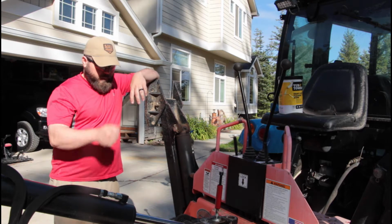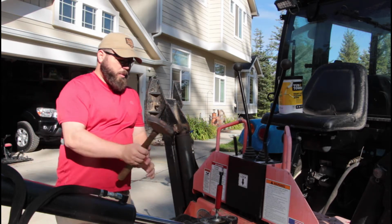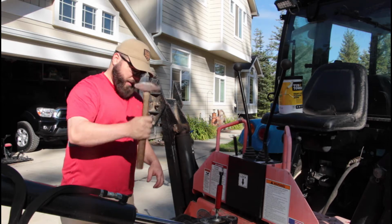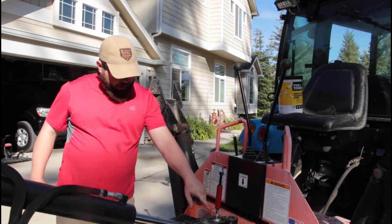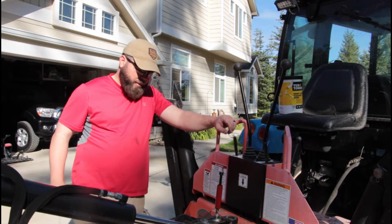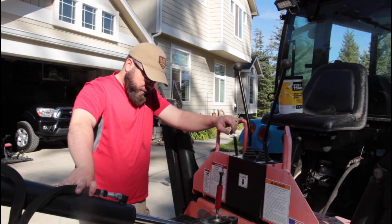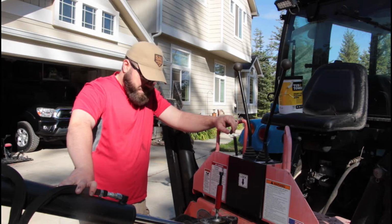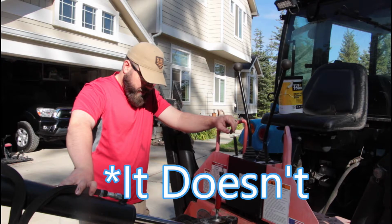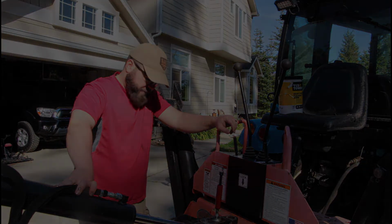And so I let this hammer bounce on there a good while, and it's pretty heavy. I was probably smacking it harder than you're supposed to, but I was also trying to pay attention around here, and I saw a little bit coming out, but not a lot, which tells me that I am forcing some of that solvent into that pin. Maybe just let it sit for a little bit and see if that will clear it out. Sure hope so, because I really don't want to pull this pin.